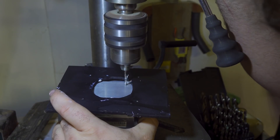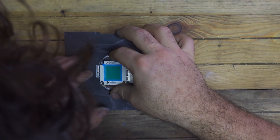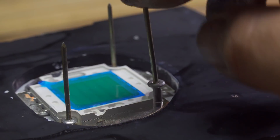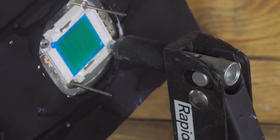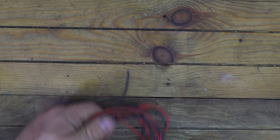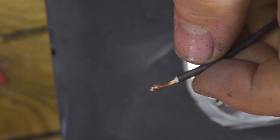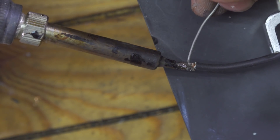Now with my drill press I can make four holes in the four corners of the LED. To fix the LED chip on the aluminum base, instead of screws I really prefer to use rivets, because they're much quicker to install and applying the rivets also applies a lot of force so all the excess heat sink compound is squished outside. Two thick copper cables are passed through the plastic base; I remove the insulation and solder them, giving me two cables that have to be connected to the LED chip.